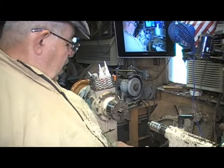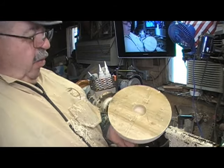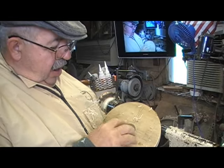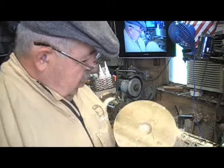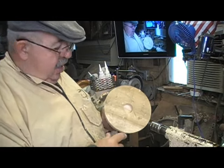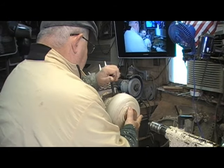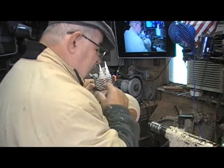So if we only have one chuck, I wouldn't do this. I would put this on a 4-inch faceplate. Center it up, make it round, drill it in, put a 4-inch faceplate. You do know the part about no drywall screws, right? It's going to be a mild steel screw because they don't crack. Drywall screws are made for what? Hello, hello? Drywall! Because they crack.